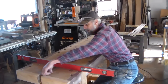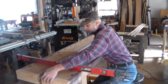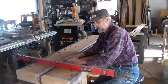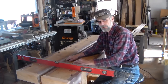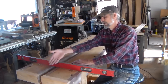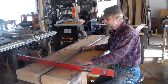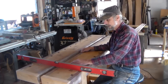And I've also got to do the insides of these dovetails because I cut the pockets deep so I can just flush them up, forgetting that once this top's wedged on I can't take them off and work on that. So I guess I'm going to take a flush cut saw and cut them as close as I can, and then maybe use files and rasps to smooth them out. I think that'll do. But I've also got to deal with the fact that this is 1 7/8 and that's 2 inches. I don't know if I'm just going to make my piece tapered, or let it be loose at that end, or how I'm going to do that. I have yet to decide.